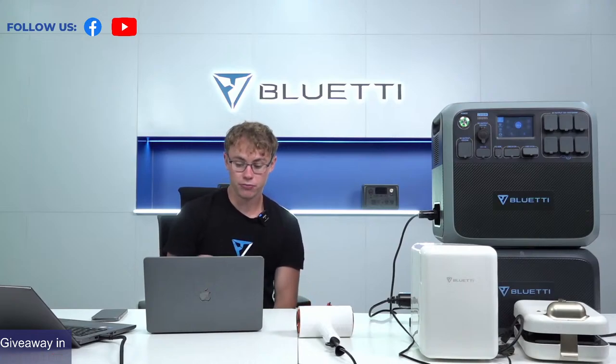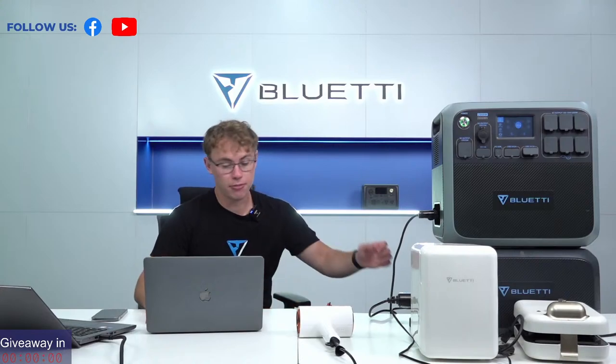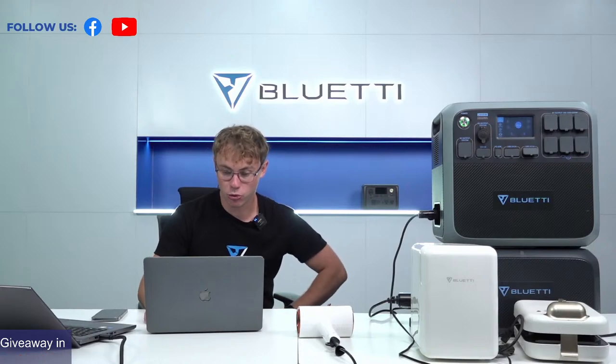From a generator, it can be a gasoline, propane, or diesel generator. And again, make sure you choose a generator with a stable voltage. Now, from a lead acid battery, you can also recharge it. Maximum current, again, is 8.2 amps. So the current limit will be 8.2 amps.